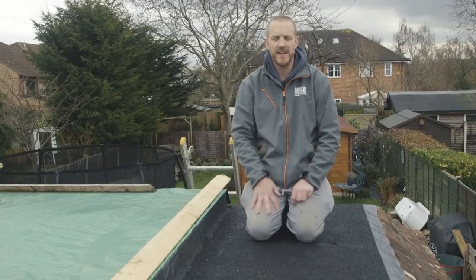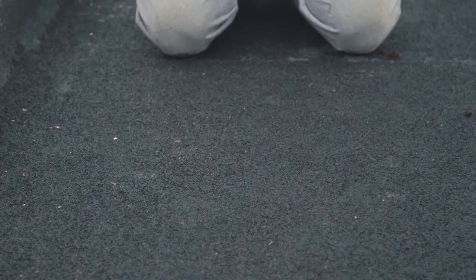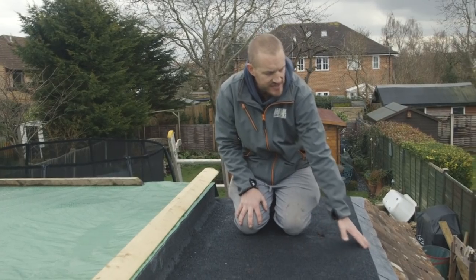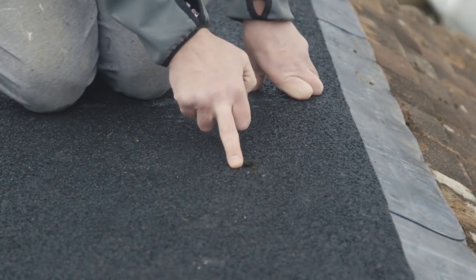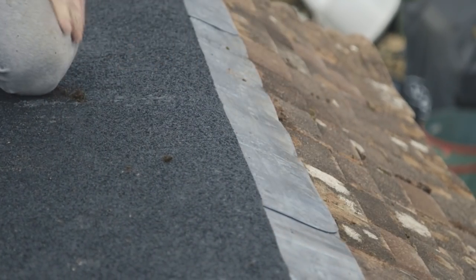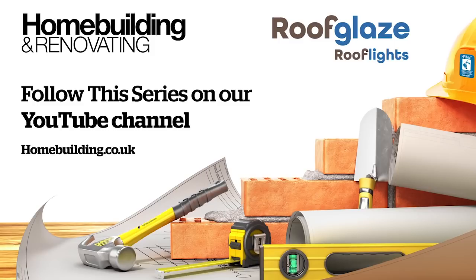We're back up on the roof and we're pretty much done, ready for the roof lantern to be fixed. Last time we were up here we had the first layer on. We've got the second layer underneath — the underlay — and then this top layer has been torched on, running up to where the lantern is going to go. Under here on the edge we've run some lead, code three lead, which we've tacked down. Then we've used a primer which has enabled us to torch down the top layer of felt, which creates a runoff for the water onto the pitch roof.